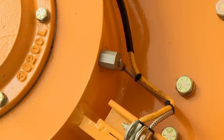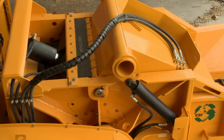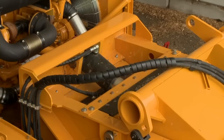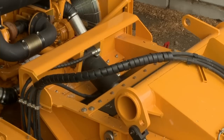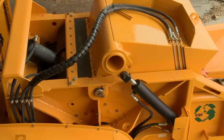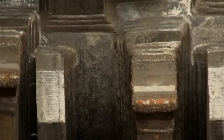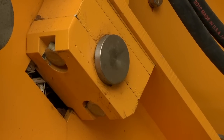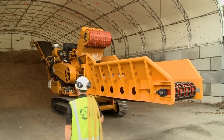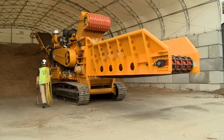The MDS uses electronic sensors on the rotor to detect the instant the rotor contacts metal. Once metal is detected, the feeds are reversed and an 8-inch hydraulic cylinder retracts the anvil and grate frame from the rotor in milliseconds, protecting it from damage. The 5800 also incorporates sacrificial tips on the strikers and shear pins on the grate frame. These act as engineered-in weak points, which concentrate the damage to low-cost components should tramp metal ever make it through.